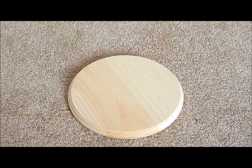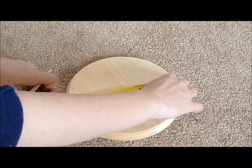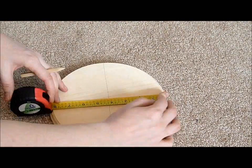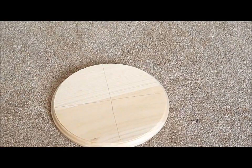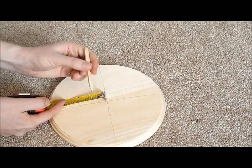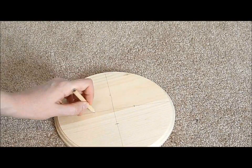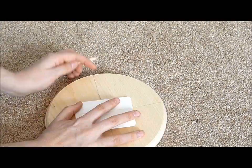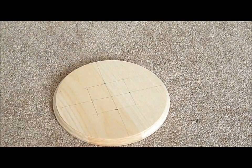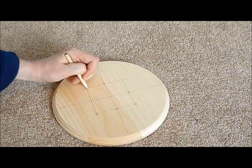To decide where you're going to put the holes to make these look like buttons, the first thing you need to do is measure the diameter of the circle and draw a line through the center, then draw another line at a 90-degree angle intersecting it. To get your points for the dots, measure an inch and a half out on each of the lines, then take a straight edge and connect them all the way around. Where those lines intersect is where you want to make a mark — that's where you'll be drilling your hole.